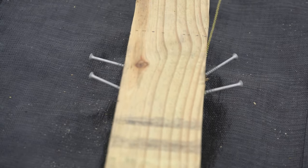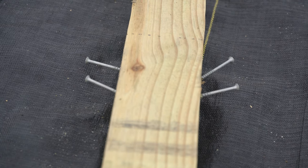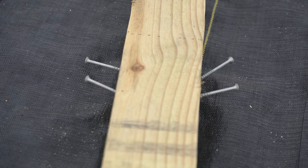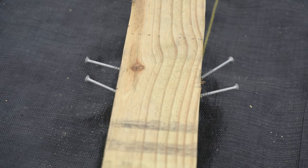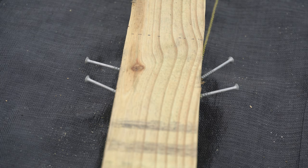What I also did — and this is a little bit of a trick — I have some 3.5-inch galvanized wood screws that are drilled into the sides of my post. The reason why is I will be embedding my posts in concrete. Normal wood posts are smooth; they don't have anything for concrete to really grab onto. So I'm putting just a few screws in there for the concrete to grab onto and give my posts a lot more structural stability.